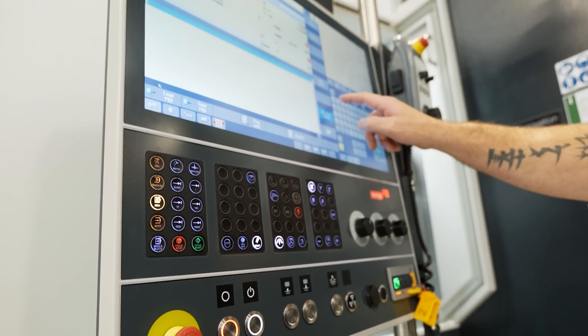Why should people buy this style of machine? This is clearly to attract attention in machine shops and get engineers to think differently, because by opting for the horizontal style machine with four or five axes is something that is not adopted enough in machine shops and should be. We really favour the horizontal spindle over the vertical - chips flush away, there's a huge chip swarf conveyor underneath the machine, no swarf traps, everything's open and accessible. It's thermosymmetrical, very powerful, but also built to a budget. The designers were tasked with not losing any of the Heckert famous functionality, but putting the machine into the market very competitively.